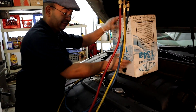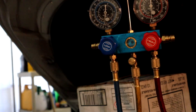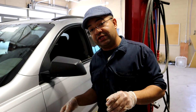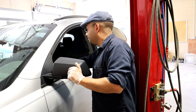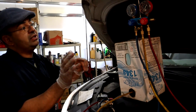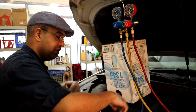We got our bottle here facing down — you can also use the small bottles they sell at the auto parts store. What I'm going to do is open the low side valve and fill it up a little bit. We have the car running with the air conditioning on high, full cold, full speed — make sure your AC is on. We recommend that every time you put Freon in, you go into the car and rev it up to about 1500 RPMs for 30 seconds so the Freon fills the whole system.